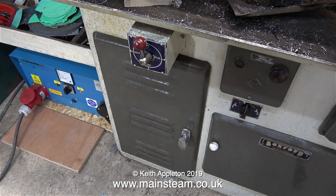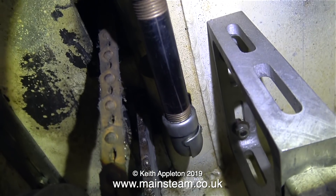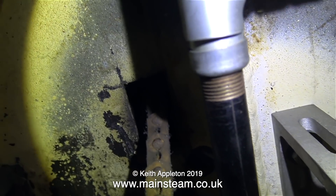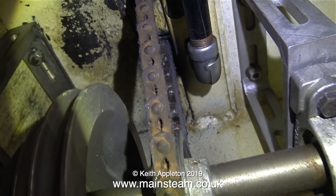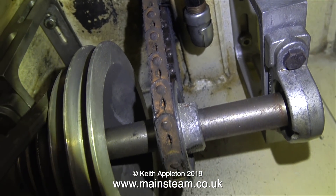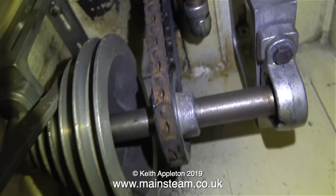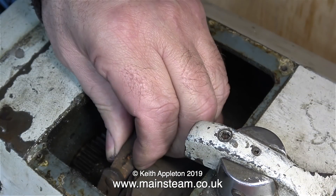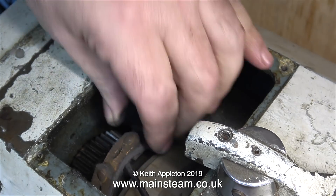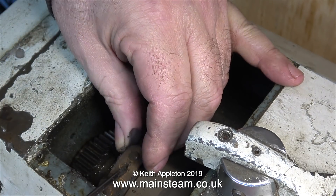Before I can do anything I need to go inside the little cupboard on the front of the lathe. Now I'm laid on the floor holding the camera inside the small cupboard. Here you can see the belt that drives the headstock and it looks a bit greasy. It's one of those special segmented belts which allows you to take links out or add links, so you don't have to dismantle the lathe much to fit a new belt. As I move the camera downwards you can see both of the counter shafts — the top one and the bottom one, and the bottom one connects to the motor. I slipped the segmented belt off the pulley inside the cupboard. Now I can get a closer look at it and yes, there's some grease on the pulley itself.